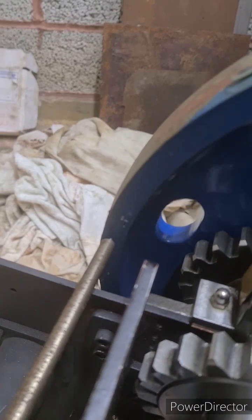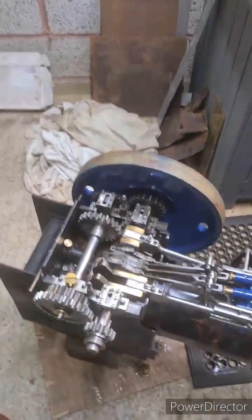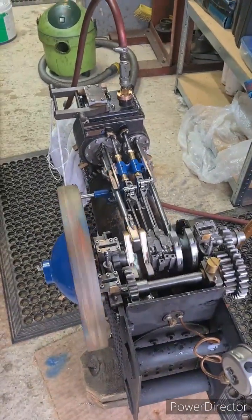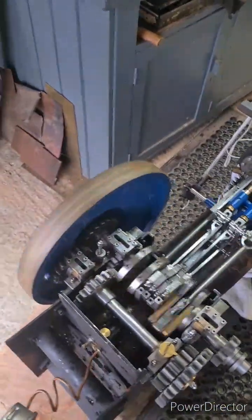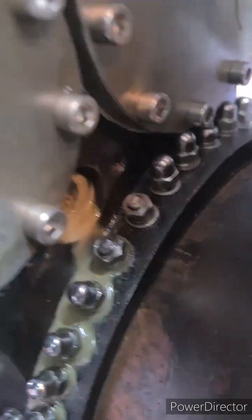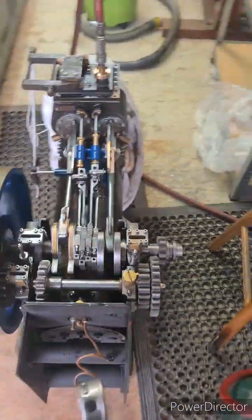With the same bar you line it up, and then you can see that is definitely top dead center. So you can find top dead and bottom dead on both pistons. I think I need to set the valves just two degrees before so they open just two degrees before - they're a fair way out at the moment. But yeah, that's how you quarter the flywheel.